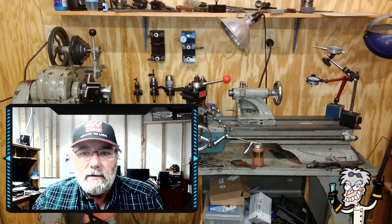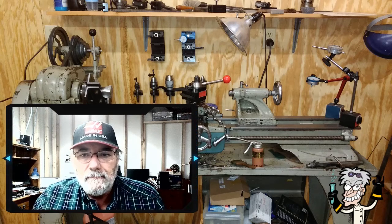Okay, but the ONVIF device manager that you can download really is pretty thorough. So the camera is in fact ONVIF compatible. Depending on how you're streaming, it is H.264, H.265 compatible, either variable or constant bit rate. So mostly all the literature about the cameras is pretty accurate.